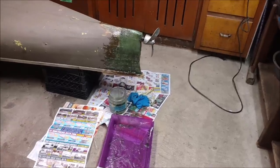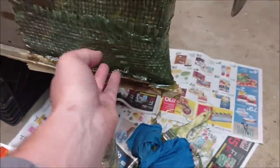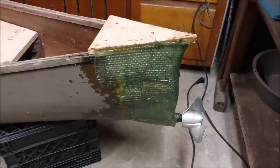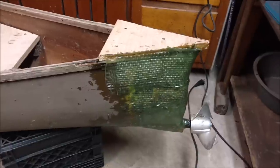I gave this a few hours to set up. And you can see it's turned this interesting green color, but this is plastic now — it's solid. I should also mention, if you're doing fiberglassing like this, it puts off a lot of fumes. And I did it inside just because it was raining. If you keep the garage door open, keep a fan blowing or something.